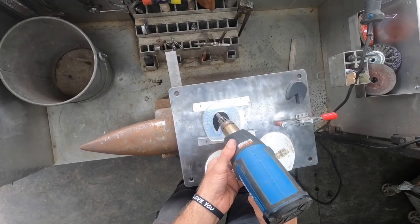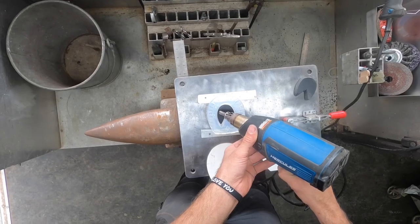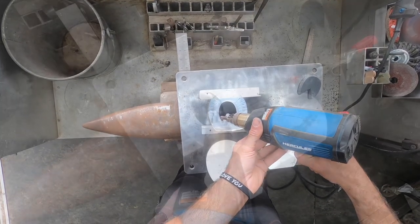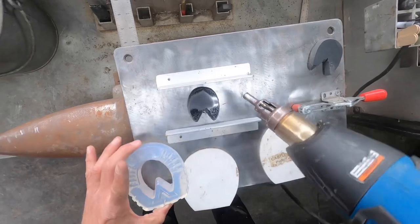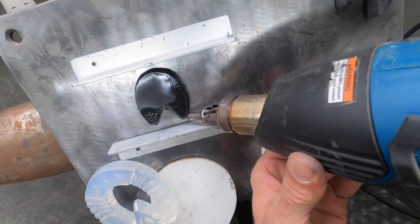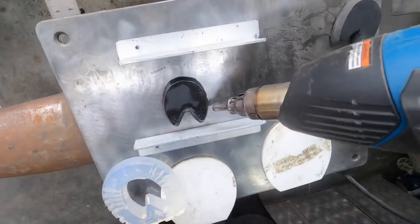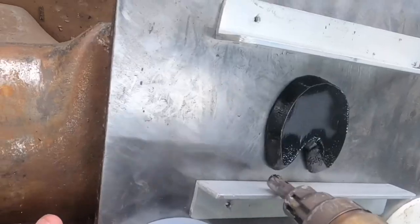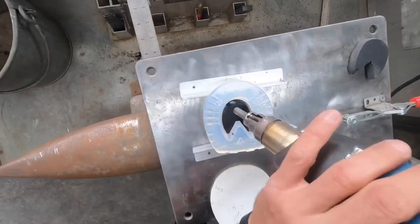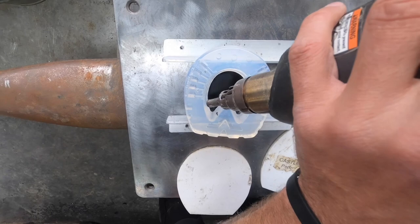So what I'm going to do here is heat up my inner rim to a welding temp. Once I see the material turn to a liquid, I'll move on and do this all the way around the shoe. Now that I feel good about getting my shoe up to temp, I'm going to go ahead and heat up the outer rim of my plug. Having it pre-warmed already allows it to hold the heat longer. Now that I've got the outer rim of my plug to a welding heat, I'm going to keep the bottom of my plug getting warm, but also make sure that my shoe is brought back up to a welding heat.